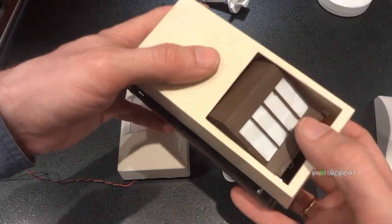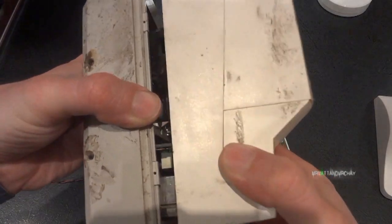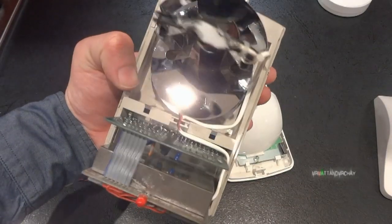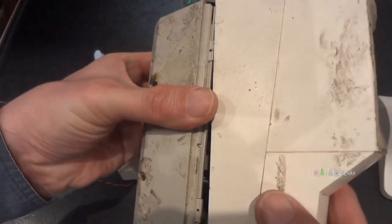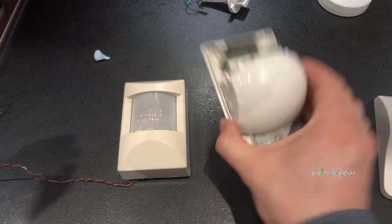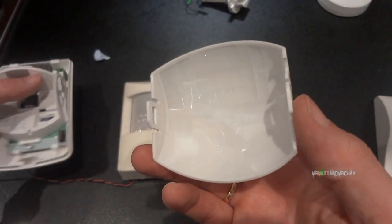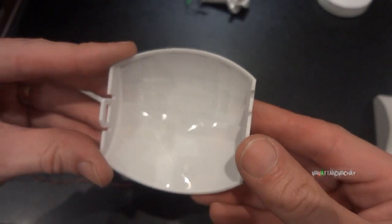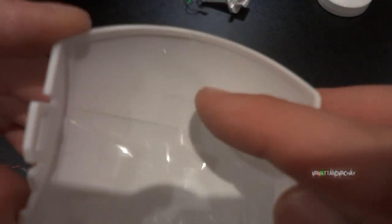The other type of lens is the long-range lens. There is your long-range mirror - one beam - and this one goes about 30 or 40 meters, projecting along one area. So those are your three different types of lenses. Now this one has a multi-zone and a long-range built into the same lens, which is a thing that Optex seem to do. If you take the lens off and turn it around, the detector now acts as a long-range detector - and there's your long-range lens.